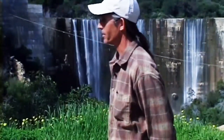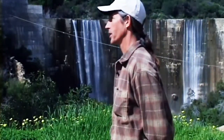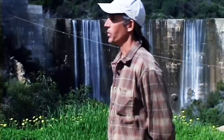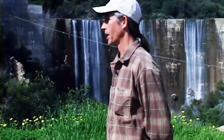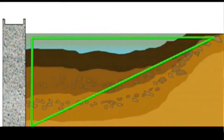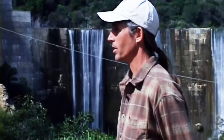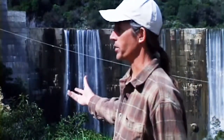Photos from when the reservoir was drained show the silt built up behind there — it's extremely shallow. What we have behind there is actually 6 million cubic yards of sediment. We call it the sediment wedge — it's deepest directly behind the dam, about 150 feet deep, and as you go upstream about a mile, you've got sediment accumulating back there. As you move further upstream it gets coarser — more like river rock and cobble and sand.